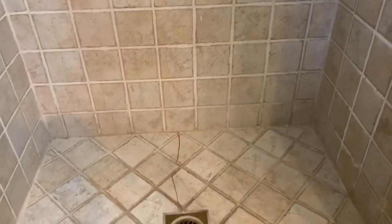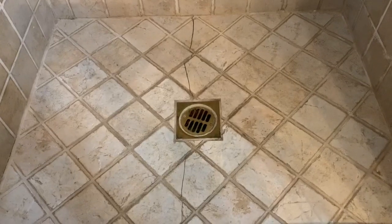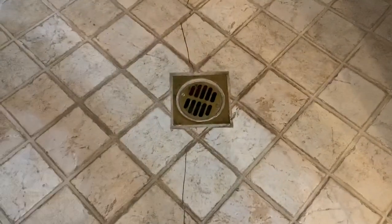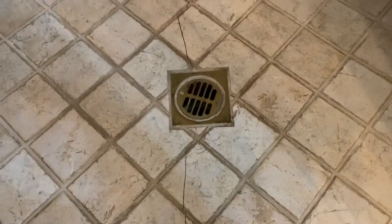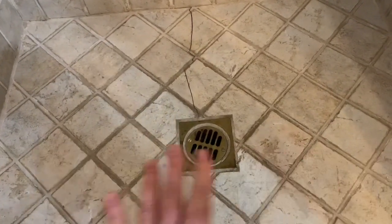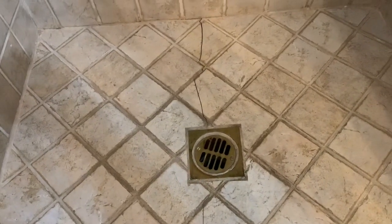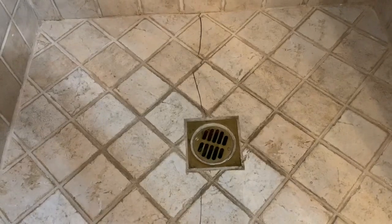Hi, I'm Mike and today we're going to be installing some modern river rock type tile over some old ceramic tile, but I've got a few repairs to make first. This is an old shower - you can see the shower pan has a small hairline crack in it and it's got an old beat-up gold colored drain. I'm gonna put some silicone in the crack, cover the ceramic tile with a bonding agent, and replace the drain frame and drain cover with brushed nickel to match the shower valve.